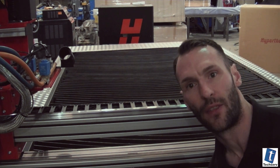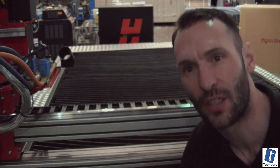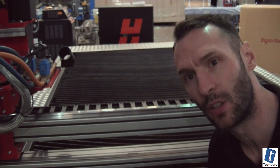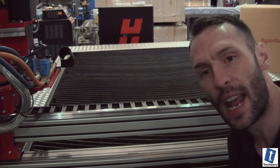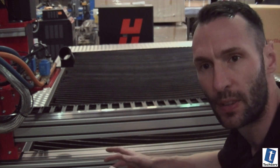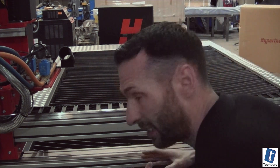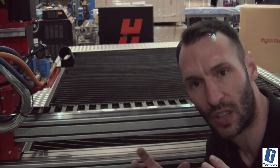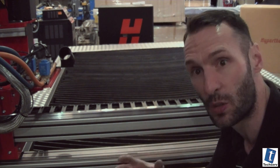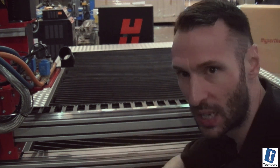There's just so much to love about the TechServe CNC machine. This aluminium, as you can see, is used by engineering and machine-building companies worldwide — it's normally sourced in Germany. Very expensive, but very light. Because it's so light, it's very dynamic when coupled up to the rest of the technology on this machine. Because we use this aluminium extrusion and it's so lightweight, we can drive the machine with smaller motors, and the dynamic, speed, and efficiency of those smaller motors is much, much better than using an oversized motor.